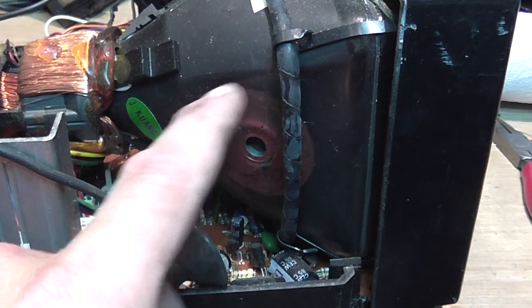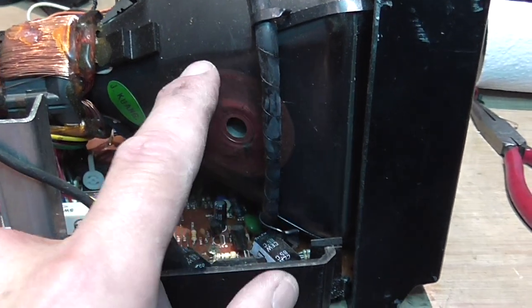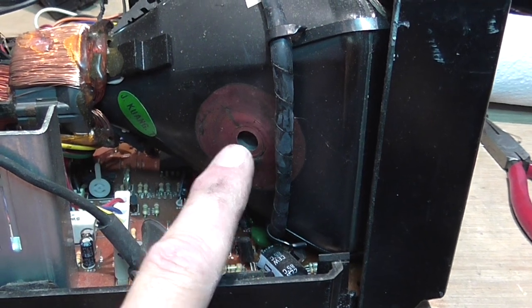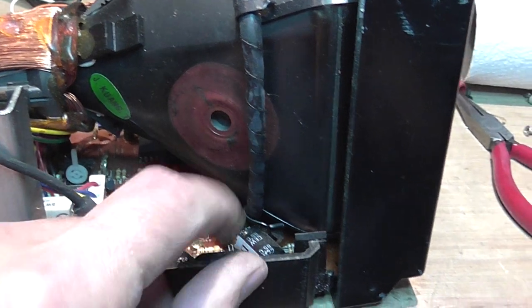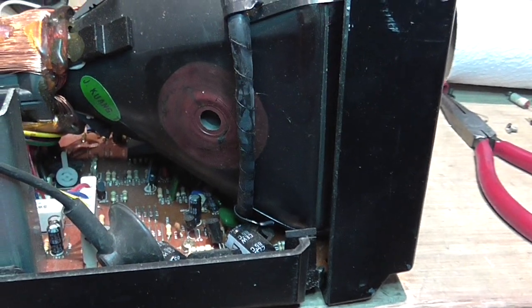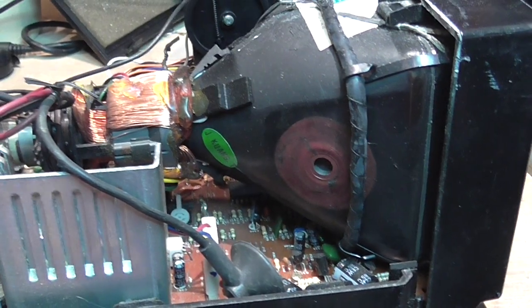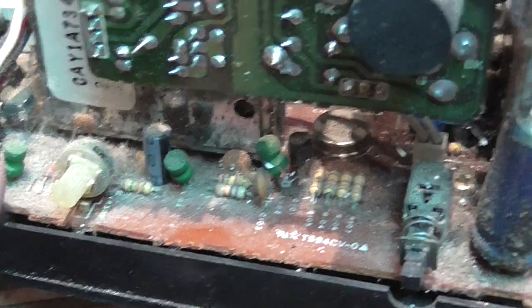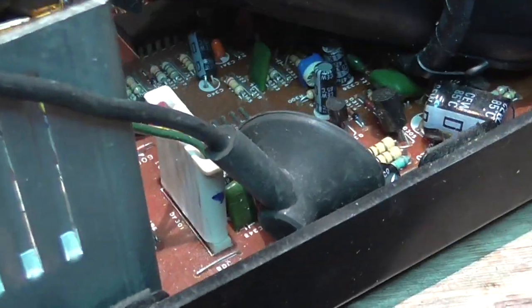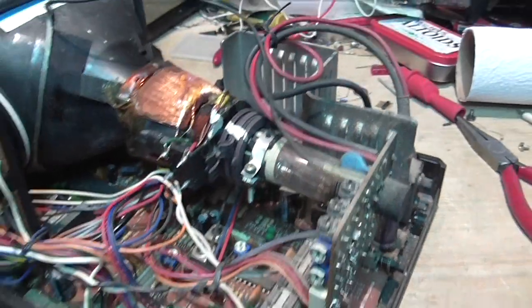What I will do now is clean this with a solvent to remove all the humidity — maybe this was stored in a very humid place and is full of mold or something, and that's why the high tension escapes through the outside. Inside it's really, really dirty, and I think I will have to replace some capacitors. I cannot see any vented capacitors, but the one in the power supply I will replace. But first of all, I'm happy because it has high voltage.